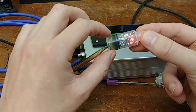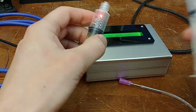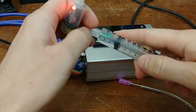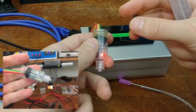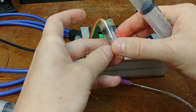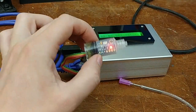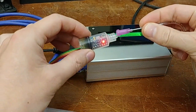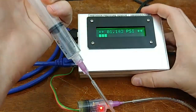You can interface the board directly with a microcontroller using an I2C interface. Of the four wires coming in, two are power — plus 5 volts and ground — and the other two are a two-wire I2C interface: a clock line and a data line. The plastic enclosure is one of these 10 milliliter syringes cut off with a razor blade. I took the little stopper off, inverted it, and filled it with an epoxy that dries hard, making it airtight on top.